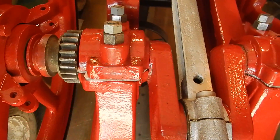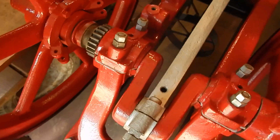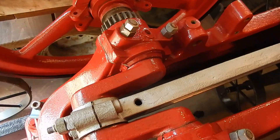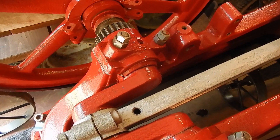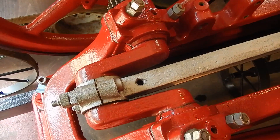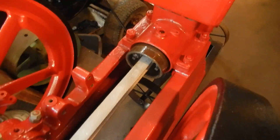I made some really thin shims out of paper. I would have liked to use really thin sheet metal shim stock but I didn't have any, so paper works pretty well. The only problem is that it compresses a little bit when you're tightening the nuts down, so it requires a little more fiddling around, but it works all right. Did the same thing with the rod — now I've got the piston in there.